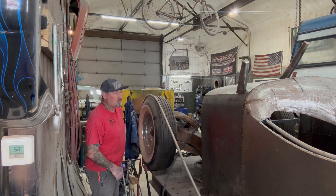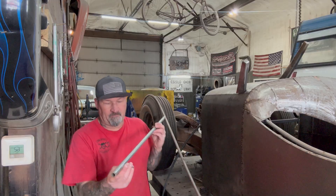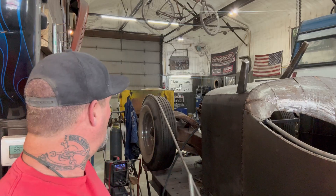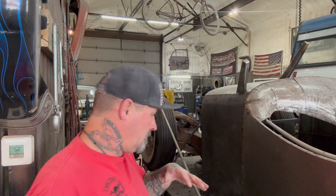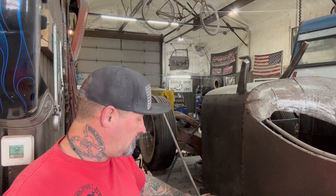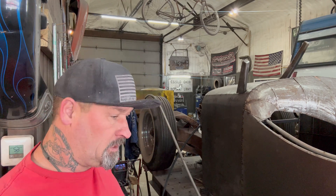So this is just mock-up. I'm taking some round electrical — half-inch electrical conduit. It's galvanized. I know somebody's going to complain about that, but I'm being real careful. It's ventilated in here, I got fans going. Be careful welding on the galvanized. But this is just spot welds to hold this piece on here, and then I'll use this piece to shape my sections of front fender.